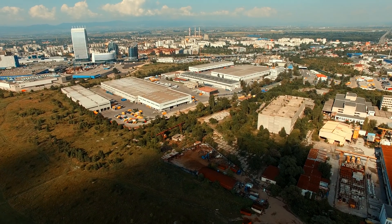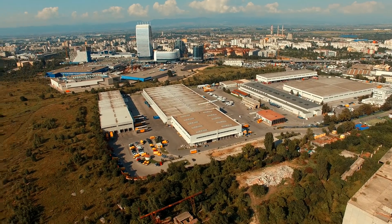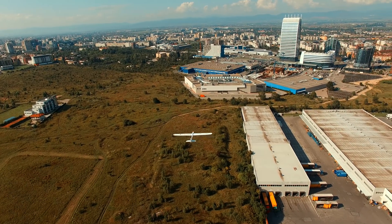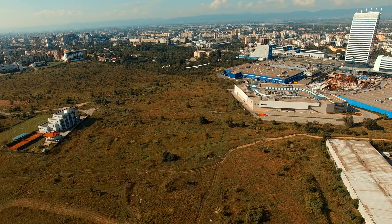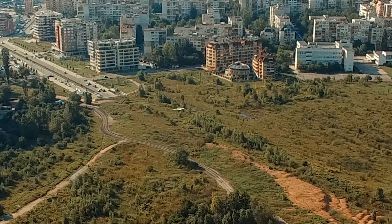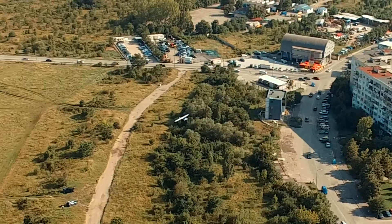I really can't say the same about these boards with iNav, because all I've seen from that firmware was weird flight behavior, random disarms and fail safes, turn locking where the plane keeps banking even after you let go of the sticks in a stabilized mode, and so on. The experience with ArduPlane was so much different and so much better. Now, the ArduPlane firmware version for the Omnibus is a cut-down version of the full code you'd otherwise see on a full-fledged Pixhawk, because the F4 processor has limited memory — but most people using this for FPV and some auto waypoint missions will never need the more advanced features that were omitted. This is running on a $20 board, not a $200 one, and it does combine some modules you would otherwise have to buy separately. I've been dreaming of an ArduPilot-compatible board with integrated current sensor and OSD modules for years — it is finally here, it is not a bank buster, and we should all thank the racing copter hype for making all of this possible.